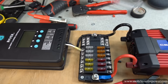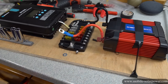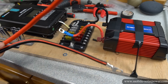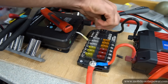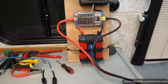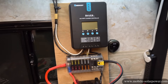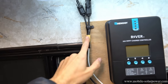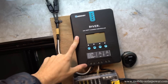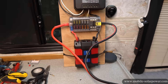Talk about minimal losses — this is such a small amount of wire to connect these two components together. We need to connect some power lines to our battery, and I have this four gauge cable — you can buy four gauge battery cables at any Walmart or wherever you are. Now we put the cover on and make sure everything fits. It looks really good — I love this design, it's very simple, small, and lightweight, you can lift it with one hand. I added a positive and negative line to an XT60 connector that supplies MC4 adapters, so I can connect any little solar panel to this system. This system is rated for 200 watts, so that's the maximum power I can push through. Tomorrow we can hook it up to some sunshine and a battery.